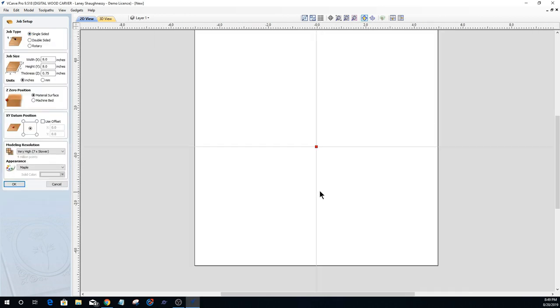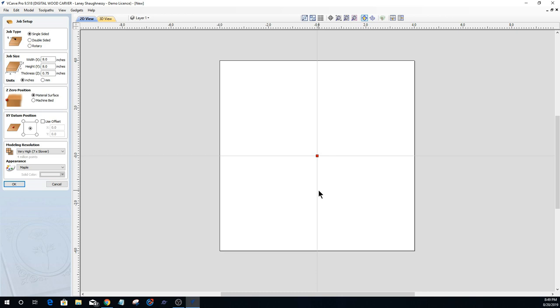And all of this can be done as a one-sided project, except for my center piece on that side rail, which has grooves on the front and the back. Well, I'm still going to do it as a single-sided part, but I'm going to end up cutting that top rabbet on the router table or something because it's only one cut. And I don't want to have to flip the part and try to clamp it and all just for that one little cut.